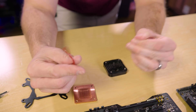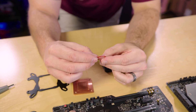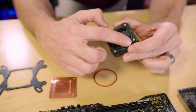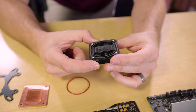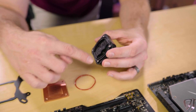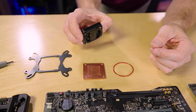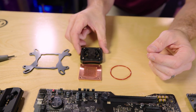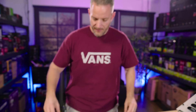There's an O-ring right here — it actually has a hair in it, a long blonde hair — but it fits into its channel. The top piece appears to be a POM material, possibly acetal. You can see it forces the flow. There's no labeled inlet and outlet because it's symmetrical — just a square. The flow is identical either way, and that is essentially the engineering behind this block.